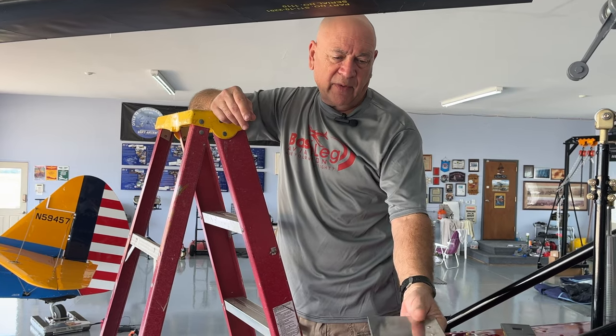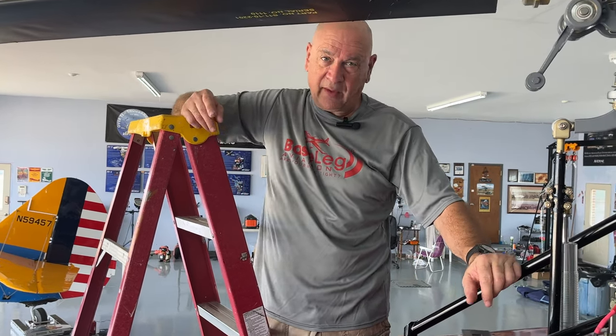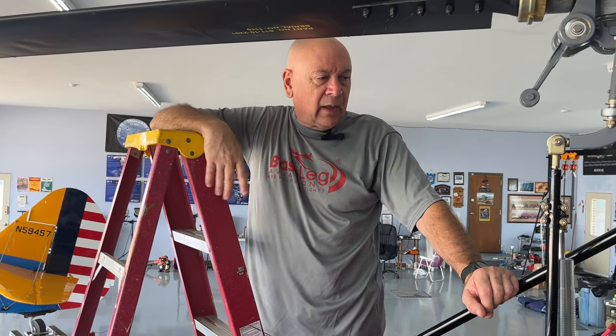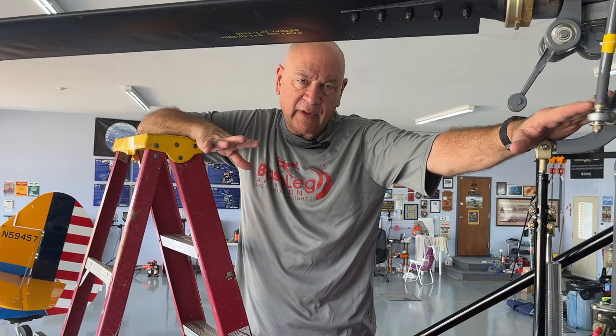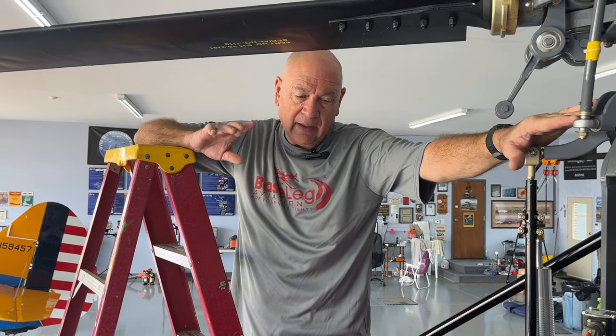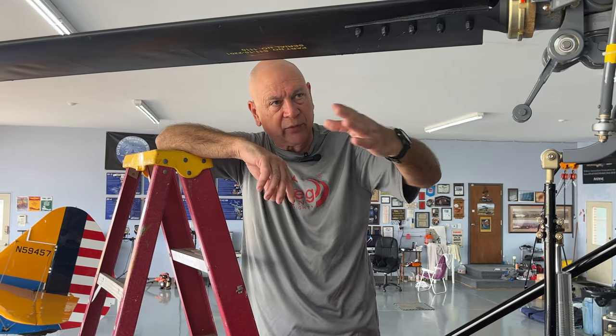Now, this is going to be a bunch of back and forth tweaking because I know some of you are thinking, well, if we're bending the blade tips out there, aren't we changing the tracking? And you're absolutely right. But again, we want to adjust for hover here. Perhaps this evening, if the weather stays good for us, we're going to put some LED bulbs on the blade tips and then check the hover and see how they're tracking. For forward flight, where the blades are moving much faster with relative air, adjusting the tips, just a minute amount, really changes the blade tracking.